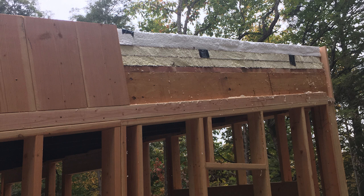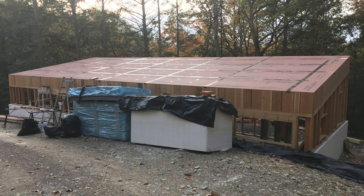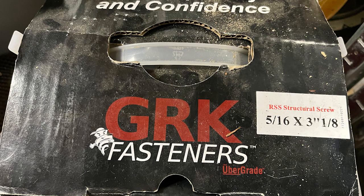Here's another picture showing how thick the foam was on top of the two-by-tens. I don't know — there's got to be people laughing at me, but how else would you do it? You had to put some kind of box around it. I couldn't do the wall sheathing before the roof sheathing because I needed to finish that insulation box first, since the sheathing is going to go all the way to the top. I want everything to be airtight — an airtight box.